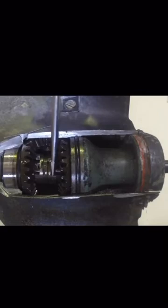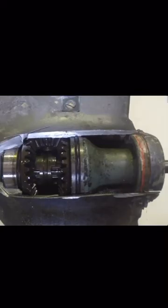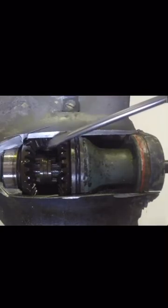At the moment, that dog clutch has got teeth on this face and teeth on that face. By teeth, I mean just large — you can see as it sort of rotates — they're not only teeth, but what's about four different squared sections. And they bite into the faces of the forward and reverse gear.